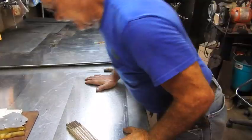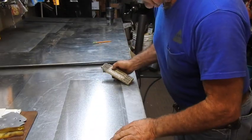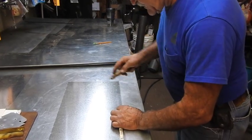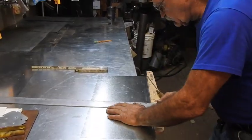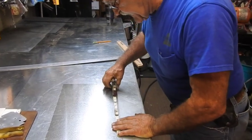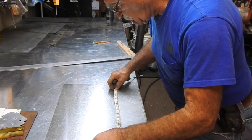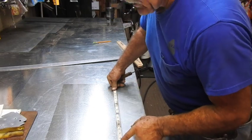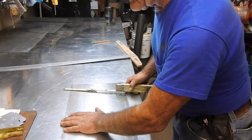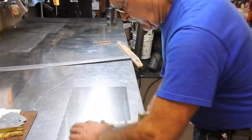This thing's only going to start off at 16 and five-eighths, and it's only going to flare out to 17, so that's just a minimal amount of flare. I'm using scrap metal — small pieces of leftover material. Pick a spot out in the middle, put your centerline mark. I got 16 and five-eighths, which is eight and five-sixteenths to either side. Double-check and make sure you've got 16 and five-eighths. We're going to flare out to 17 inches, so we need the actual height — nine and a half inches in addition to the flange. Go off of the flange and put your nine and a half inch mark.